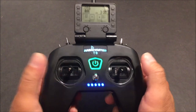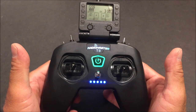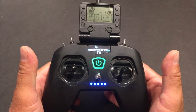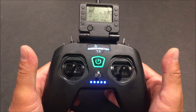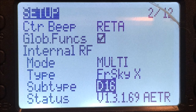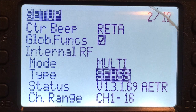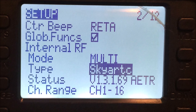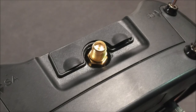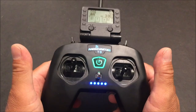The T8 Pro is a very well-made 16 channel compact remote controller with the CYRF6936 multi-protocol chip and two built-in 500 milliamp replaceable batteries. The multi-protocol chip supports Corona, FrSky D8 and D16 protocols, Hitec, HOTT, RadioLink, SFHSS, and more. It comes with hall sensor gimbals, the do-it-yourself antenna interface, and the quick release folding display with full OpenTX support.